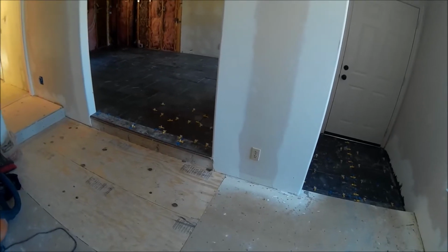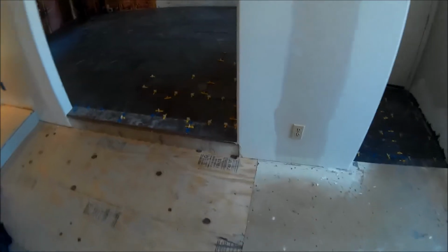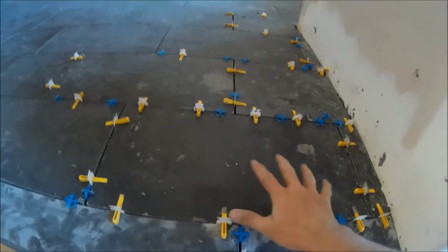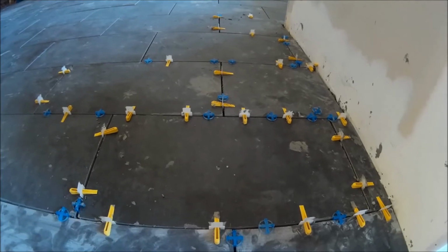But yeah, thanks for watching. Hope you learned something there. If you ever want to tackle a tile project, I would definitely suggest these little levelers. A lot faster than having to use your own straight edge and board and pounding it all, squeezing it all. You still got to squeeze them a bit, and you definitely want to do the double buttered, but I would recommend this system for sure.